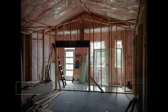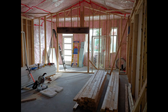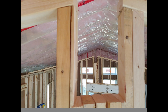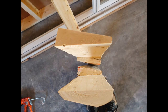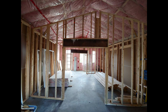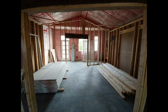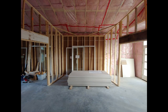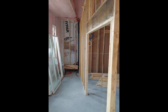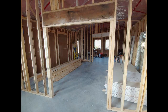The angled walls were a complicated build. I started by getting the door centered where it needed to be, then building up to the peak, putting the top plate on, and cutting each stud to the right length based on the angle present. I built the notches in the top for the ridge beam to go through — that required some creative work on the table saw. The walls were angled at 12 degrees and the ceiling peak was angled at 11 degrees. I built the other end of the control room wall at this point too, getting the drywall onto the outer sides of these walls before building the angled wall in the tracking room.